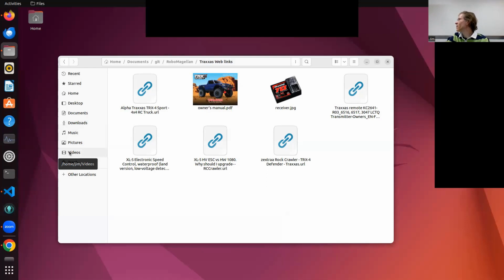Command velocity is the one. Is that a standard ROS message? Yes, cmd_vel is standard. In fact, if my router is working here, sign me up and I will do a demo of controlling the robot from ROS, manual control. It uses command velocity, and inside command velocity comes a Twist, which is an angular velocity and a linear velocity. Command velocity is the topic, and inside there's a message for the linear and angular velocity.